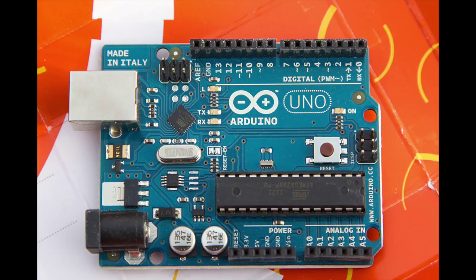The pins: you've got a 3.3 volt output pin and a 5 volt output pin, so you can power most devices directly from those. There are ground pins, six analog input pins, and 14 digital input and output pins. There are a couple of other pins on there, but you don't need to worry about those — we will learn about them in later lessons. So that is what is on an Arduino board.